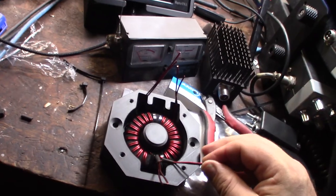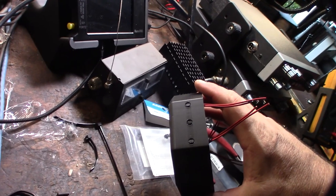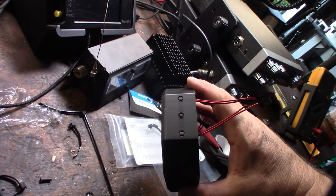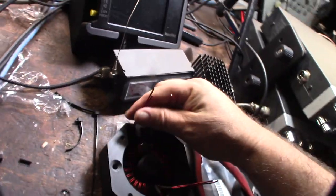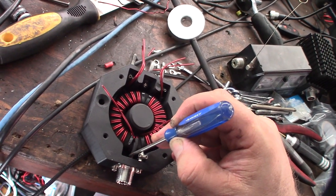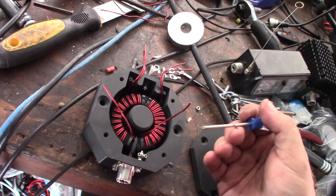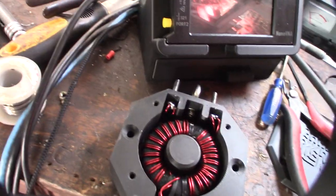The box layout shows positive-negative connections. I'm going to use stainless M5 hardware — hopefully I have some stainless spares. I knock out the holes, install the SO-239 connector, start trimming and get everything in place. I've got the leads in and now I've got to solder the wires up. These two go to the center pin, and these go to ground. I'm cutting the enamel coating off, then flipping them into place. The case cover looks pretty good.